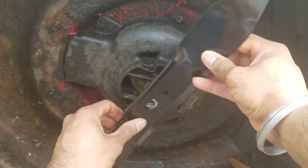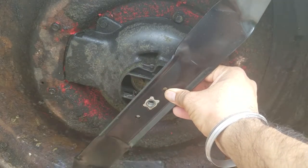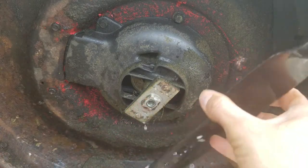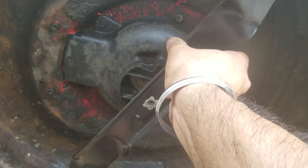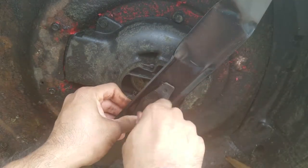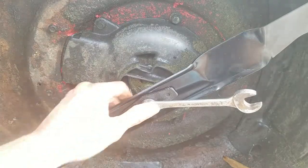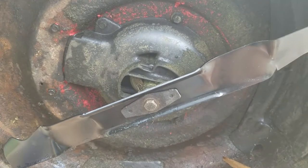Be careful, this thing is a little bit sharp. The way I want to mount it is flange side down. Take a little bit of penetration fluid, just push it in — it prevents rust. Plant it in, start tightening it by hand, then take your wrench and tighten it, and for good measure just bang it once. That's it, this is done.